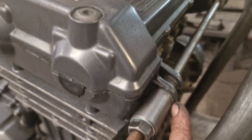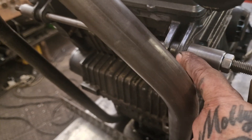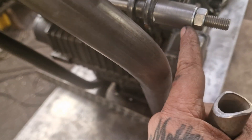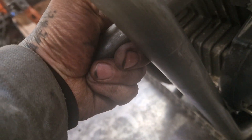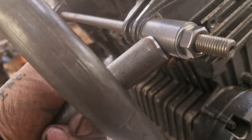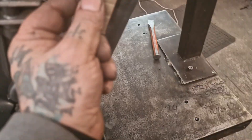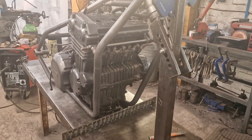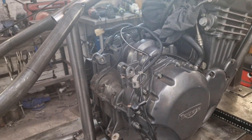With those dummied in — there's three layers of masking tape behind each one because on mine it was incredibly tight when I came to get the engine back in after powder coating, so I'm giving myself a bit of room. Here's those things tidied up — a bit of countersunk on the outside, and we're going to have these kind of sitting in here like that. That's next — trim those up and get them in place. We've drawn out from our CAD — our cardboard-aided design — where we're going to plate these. It's a big job: four plates, eight different threaded bosses.